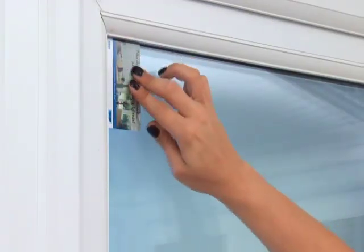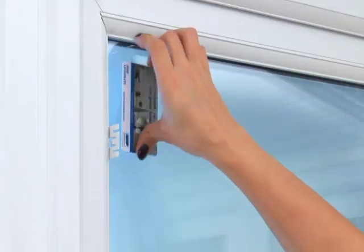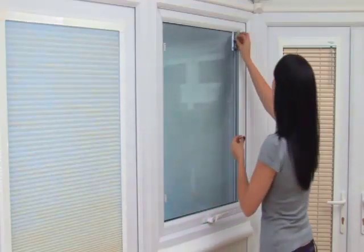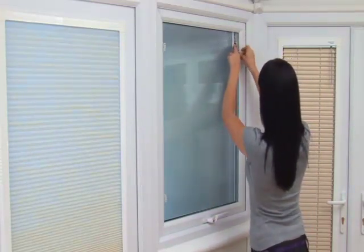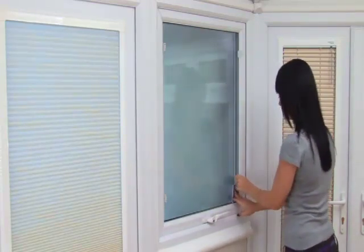You'll need to fit four brackets into the window frame, onto which your blind will simply click into place. For correct spacing, position brackets 85mm from the top and 85mm from the bottom of the window. Place one side of a credit card-size spacer into the corner of the window; at the opposite end of the spacer, insert a fixing bracket between the glass and rubber seal. Repeat for each corner. Using a credit card-size spacer guarantees that the holes on your perfect fit frame will line up accurately with the lugs on the fixing brackets.